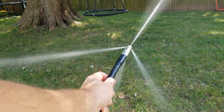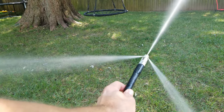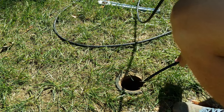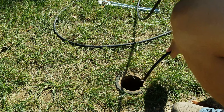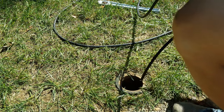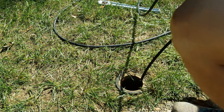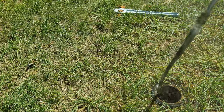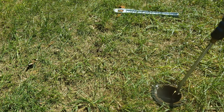As a first pass, I ran the entire 100 feet of hose from my clean out access all the way to my house, working slowly whenever any resistance was felt to help clear out blockages encountered along the way. At first I was worried the jetter wouldn't run the full distance, but I was super impressed at how well those rear nozzles helped propel the jetter through the line — it actually worked its way through pretty easily.